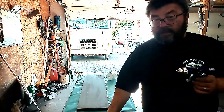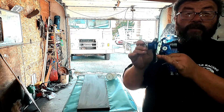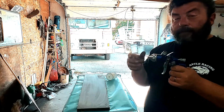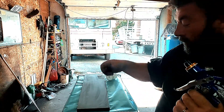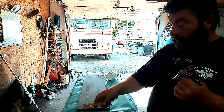The first thing you want to do with these cheap guns — any of these cheap guns, it doesn't matter which one you buy — you want to take them apart. They're shipped in oil, and that oil will cause you havoc when you're painting. Oil and paint do not mix. You can see from the shine on that — it's full of oil. So the first thing you're going to have to do is take it apart.